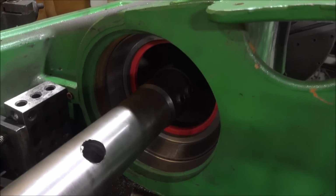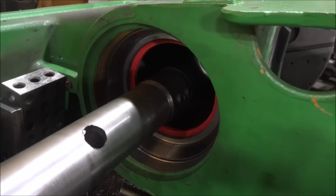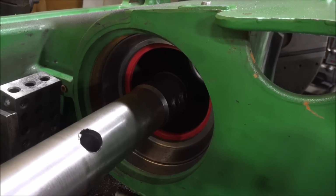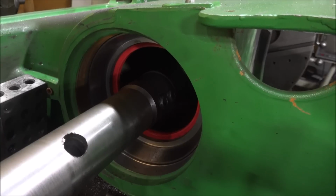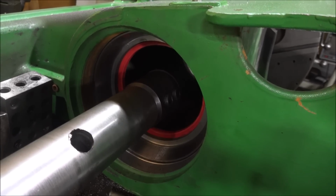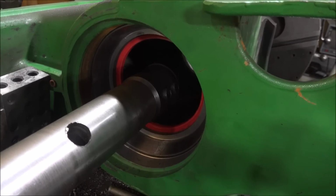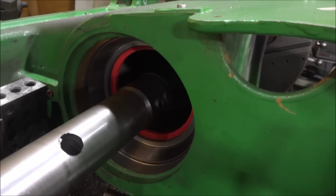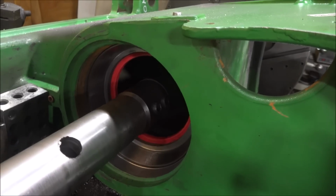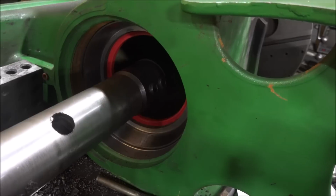Bearing was just a little bit too tight, but I got it to where it would tap in there now. So you've got the little grease seal pocket, which seals to the shaft, and that V seal is supposed to hold the grease in. It says it's important not to use an electric grease gun so you don't blow that out. Use a manual grease gun so you've got a feel for it.